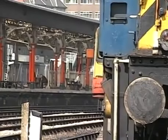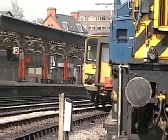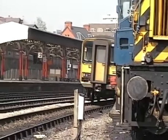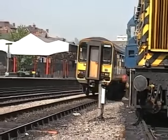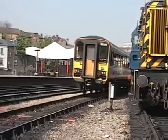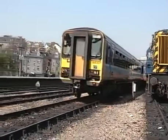If the defect occurs at an unstaffed station without facilities, or between stations, then, after having advised operations control, the traction interlock switch must be isolated after checking that all doors are properly closed. The train may proceed to the next station for assistance.